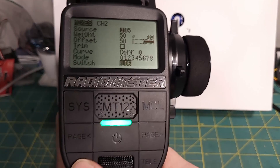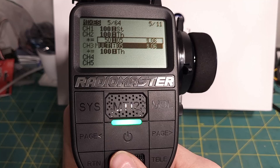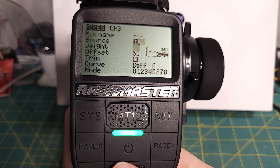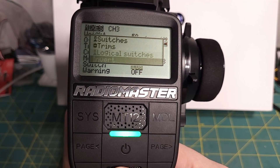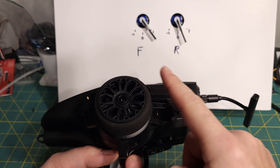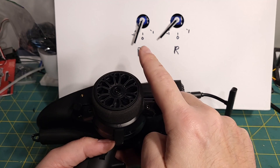That mix is now set up correctly. We return and copy it into channel 3 as well so they're set up the same. But for channel 3 — the rear motor — it should be flip-flopped: we only want that active in forward. Long press and edit, come down to the switch, and instead of being the inverse of logical switch 6, set it to logical switch 6 directly. Now with the knob at the halfway position — 50% overdrive — moving the throttle forward gives 100% front and 50% rear. In reverse it flips: 100% rear and only 50% front.